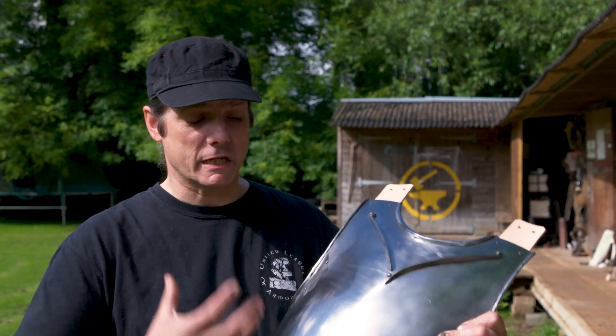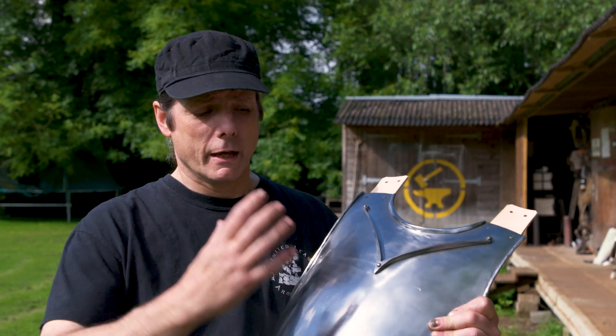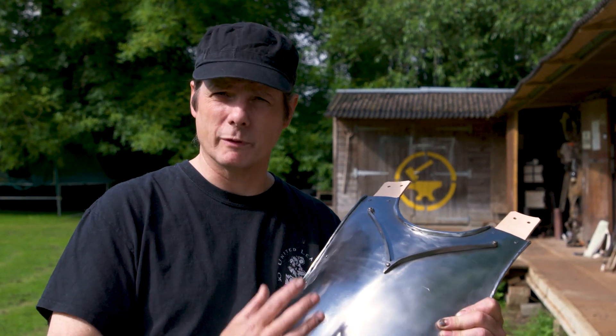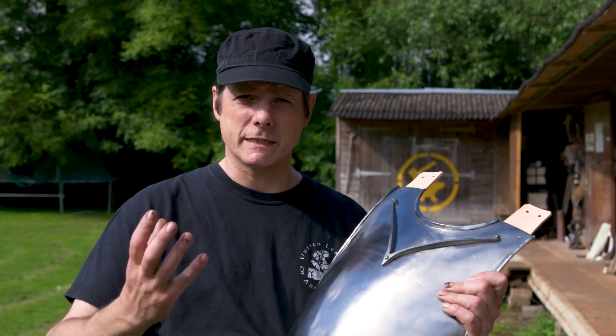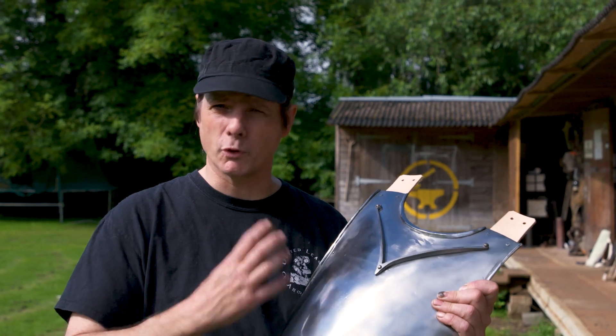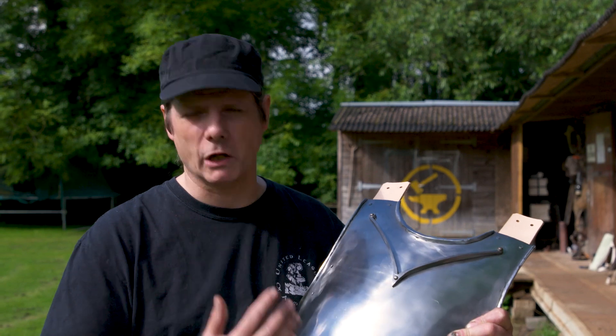The latest research shows us so much more information than we used to have, so we know the carbon content of the original piece and the thicknesses, and I've copied those as best I can. The original breastplate is made from up to 0.6% carbon steel, but it varies throughout. This is a modern steel at 0.5% carbon — the closest modern equivalent we can go to. The original wasn't heat treated, just heated and air cooled. This has also gone through that treatment — heated and air cooled, not fully hardened and tempered. Same hardness, same thickness, same weight — as close as I can get.